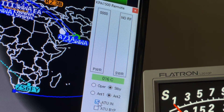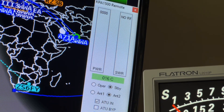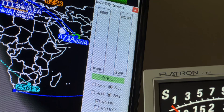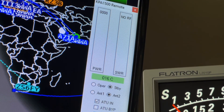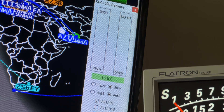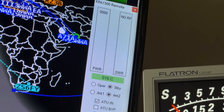After the rain, when the sun comes out and dries the moisture off, you would have to retune again. In my case, I don't even need it at all with that ZS6BKW. But on the doublet, if I tuned and compensated for the moisture, when the moisture is gone I'd then have to do a new tune cycle to go back to what my matching should be when it's dry. Just know that your SWR is going to change if you're using an antenna with a ladder-type feed line, but also other antennas can shift a little bit with moisture. In the case of Mac with his DX Commander with snow down at the base — that's probably to be expected.